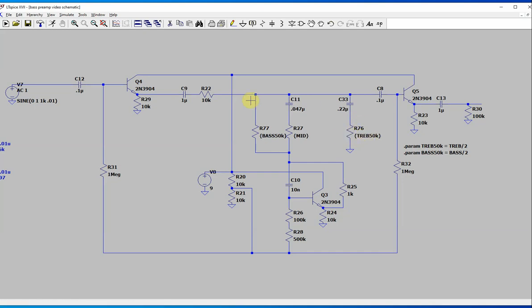The 50K, now you can see there's 10K versus 50K, so this is forming a voltage divider, there's signal loss. But I'm going to go into an amplification stage here pretty soon, so it doesn't matter as much. And then I used 50K here, seemed to do well. If you put a bigger linear one on, it just tapers funny, it goes from zero to nothing when you barely move the pot.